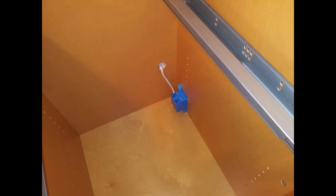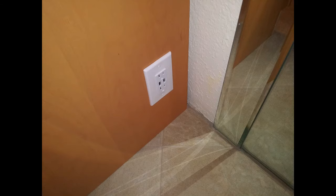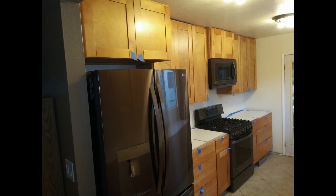Here's the modified spacer with the bottom cut off and set back appropriately to match the pantry. I had to take my time and work carefully because I only had one shot at making this modification — thankfully everything turned out perfectly. I also didn't want to access an outlet from down inside the cabinet, so I hardwired a pigtail extension and installed a wiring box and an outlet into the side of the cabinet. While I'm sure it's not up to code, it's good enough for me — and this outlet even has a couple of USB charger ports as well.